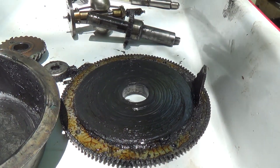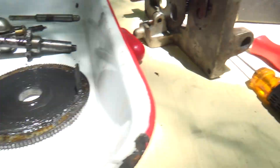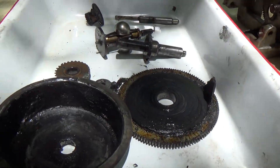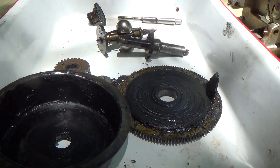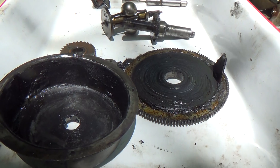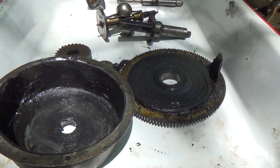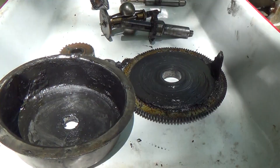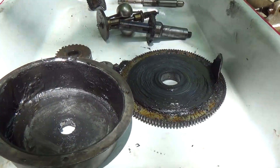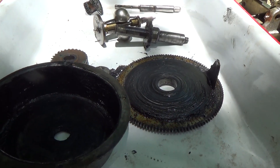That grease is still fairly liquid — it's not really as chunky and dry as I generally find. The reason for this is that the main spring, as you can see there, has apparently been replaced. It's not a Victor original. It still has quite a bit of spring strength to it. Unusual, only in that this came out of a machine that was really derelict, obviously abandoned somewhere for a very long time, yet whoever had the machine had had work done to it — a brand new main spring put in there, and it was a good brand, and it's still in good shape.